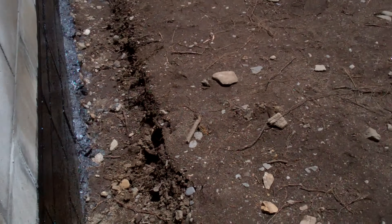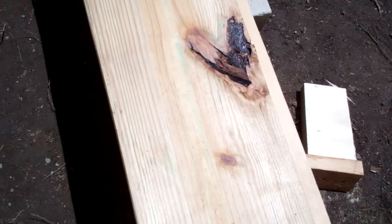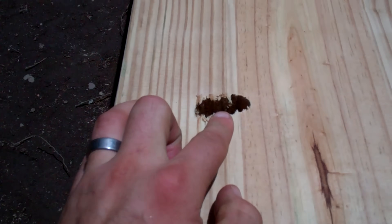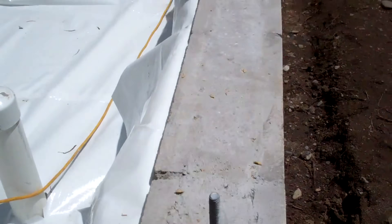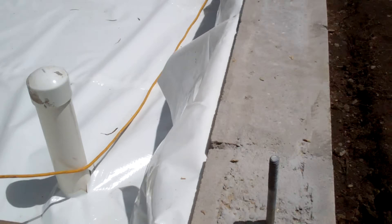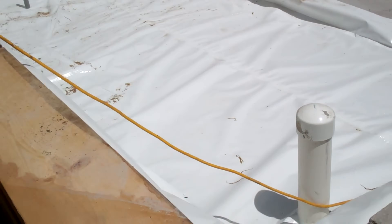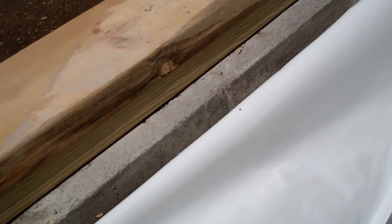One wall has two by six. And then this front wall here, these are actually the massive two by 12s that I went out and got. Because in one corner there's so much of an overhang that I actually needed two by 12s to kind of cantilever out and then come back in over the foundation enough to grab the anchor bolts. You can see how wavy it is — what a mess. But at least now with the wood framing it's going to be a square structure.